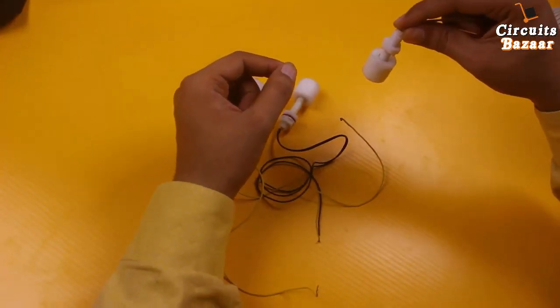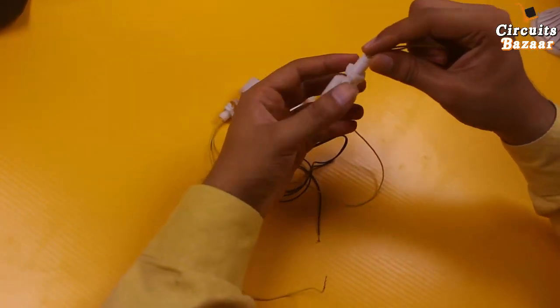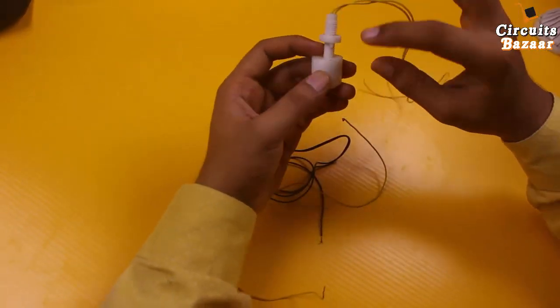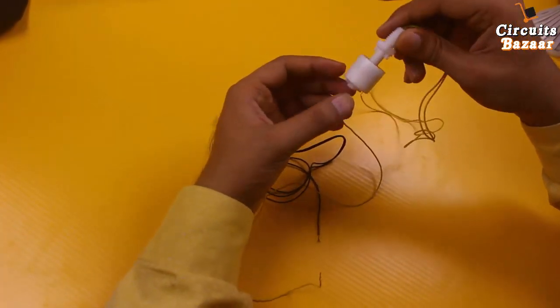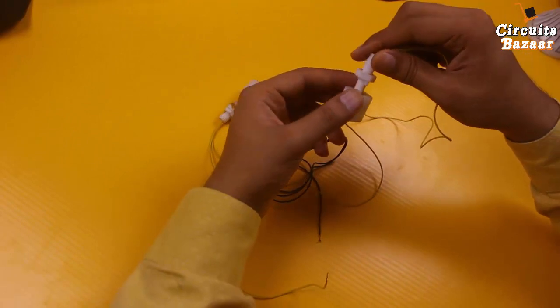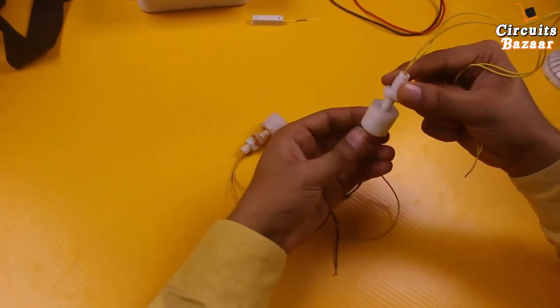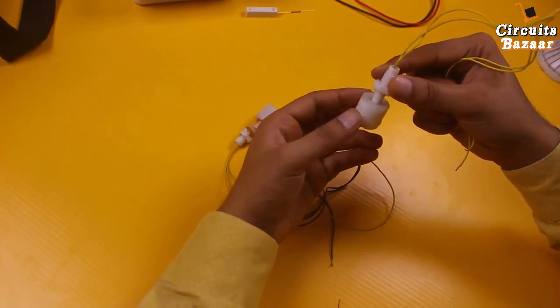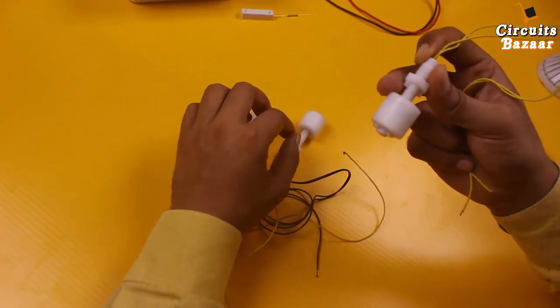This is the floating part — the moving part. There is a reed switch inside this sensor. They come in two logic types: either continuity is made when this moving part goes up, or continuity is made while this moving part is down.